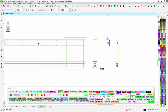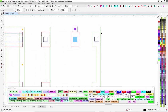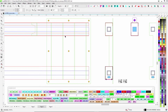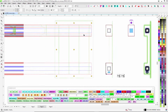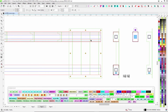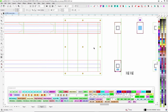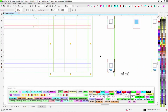And then that 2x2 3/16 will slide through this 1/4 inch plate that has a 1/4 inch vertical, and that gets welded. So you see like this one has 4 of them here, and then that 2x sliding through, and we can burn that really good. And then that 2x is connected directly to this plate, and then we can burn that plate all the way down. And then when we make the raceway, the 090, we kind of notch it and stuff, and it'll cover that, and just make it look clean. And then you'll have just these bolts here. So that whole flat plate will just mount right to the concrete, be nice and strong.